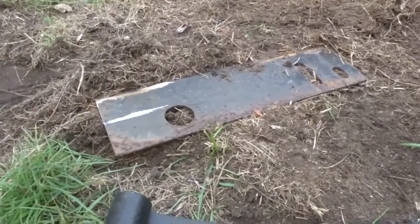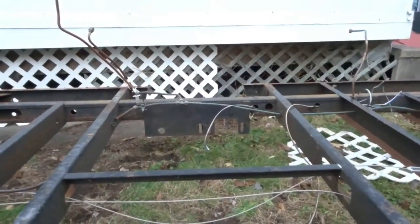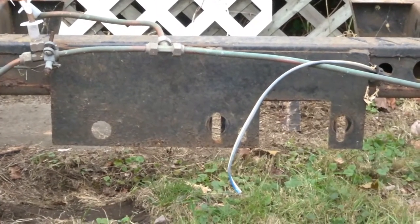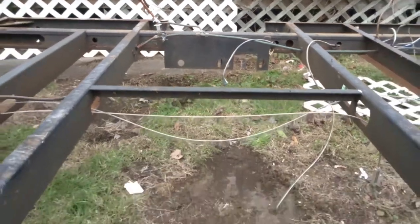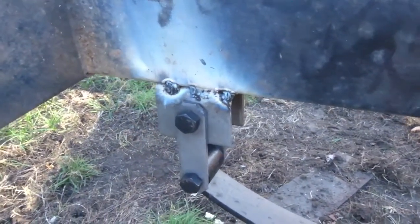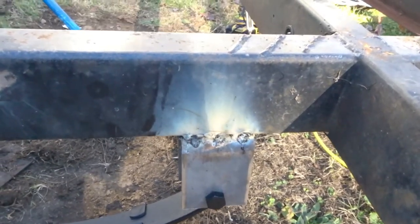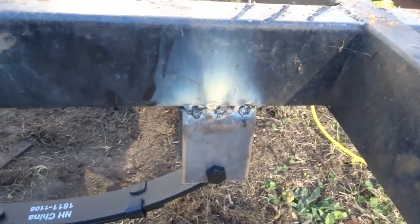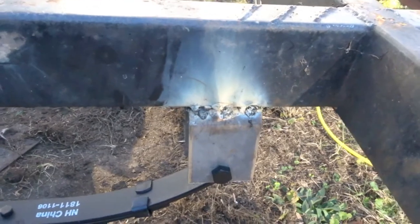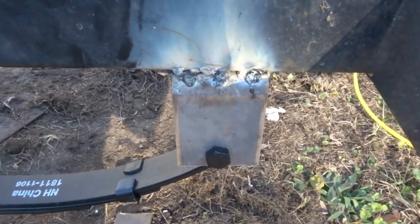I decided not to wait for the plasma cutter because this was going to be in my way when I went to go put the axle on. The axle does go over the spring, so the axle would push right up into that plate. So I took out the grinder and hacked that thing off. It's going to be a trip to Home Depot and take it from there. Mounting those springs was a lot harder than it was supposed to be — not mounting the springs themselves but trying to weld it. This is my first time using a flux core welder. The wire that was in yesterday was older wire and it had some surface rust — you could hardly see it, but it wasn't welding properly. So today I went out, got some new wire and they're solid as rock. They'll get me where I'm going, and then once I get to my dad's house I'll be able to lay some better welds.